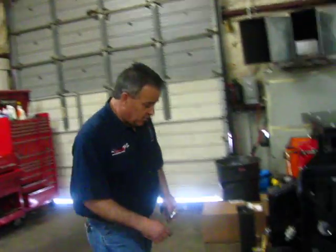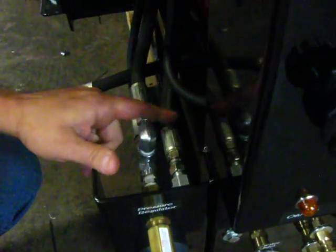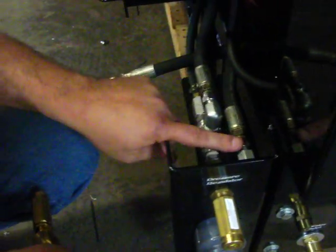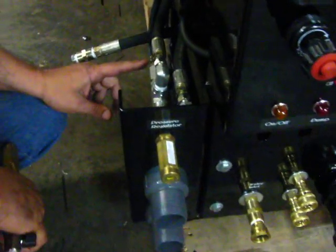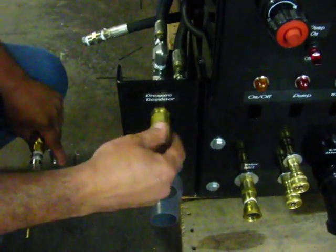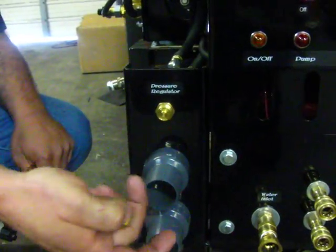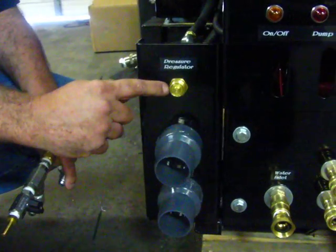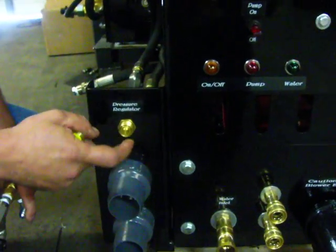As far as removing it, you're going to need a one-inch wrench to remove the regulator off the unit. First, remove all your hoses and make sure you mark them — designate what hose goes where. You use the 11/16 to remove the high pressure hoses, and also a screwdriver to loosen the hose clamp and remove it off the valve. To get it off the panel, simply remove the cap, which houses a spring inside, then use a one-inch wrench to remove the retaining nut that holds the complete assembly against the panel.